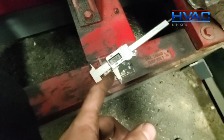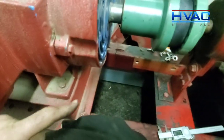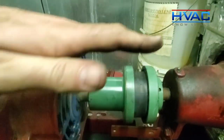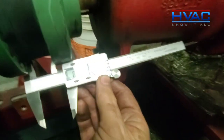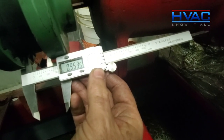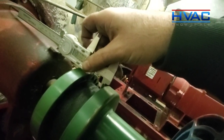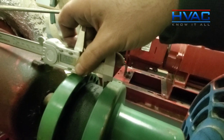Checking angular — we're going to do it with a caliper and I'm going to do the top and bottom first, because if the top or bottom are out, we need to use shims to shim the motor to get the angular alignment correct going up or down. I can't get fully underneath because of the pump bracket, but you can see we're about 0.95 there. Checking the top — that's upside down but we're 0.99 there. So our angular alignment is out going up and down, and the way we fix that is we raise the motor up from the back to close the gap at the top.